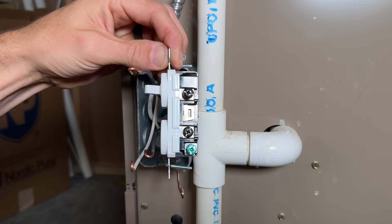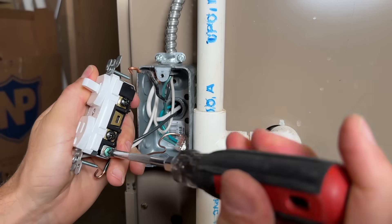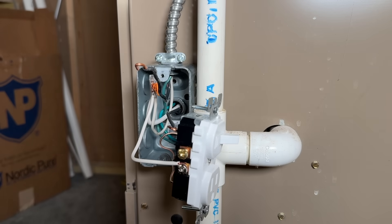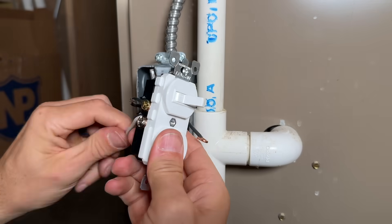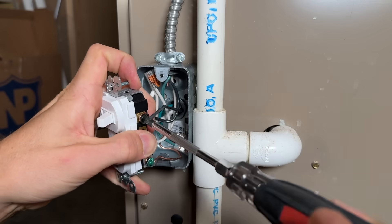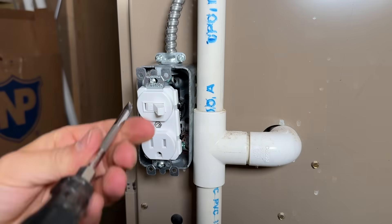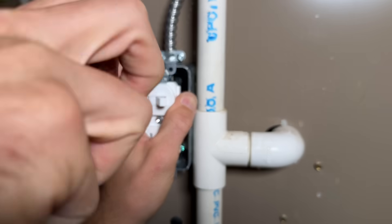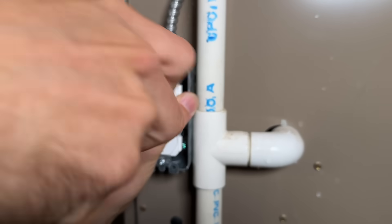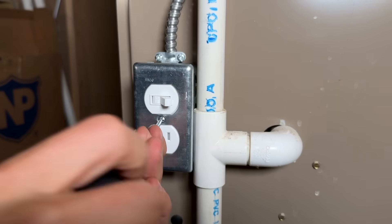Add the green ground. Since the screw terminals here place neutral and hot on the same side — unlike a standard outlet — take your time and don't strip extra insulation, to avoid exposed copper with hot and neutral right next to each other. Tighten everything up, set the outlet and switch into the handy box, and finish with the appropriate duplex outlet face plate.